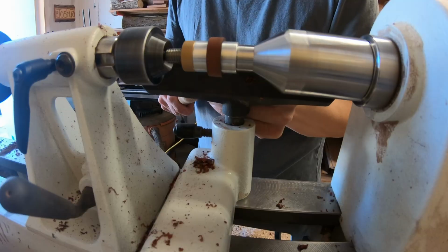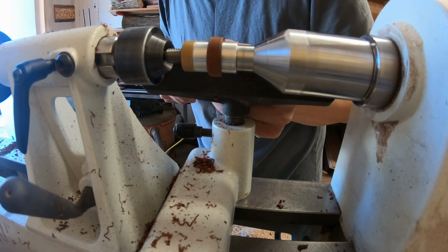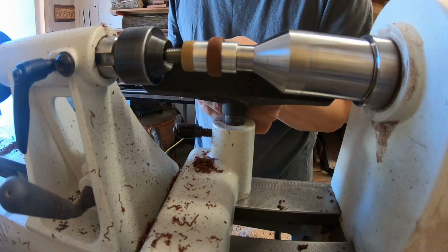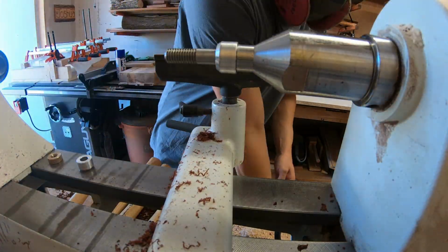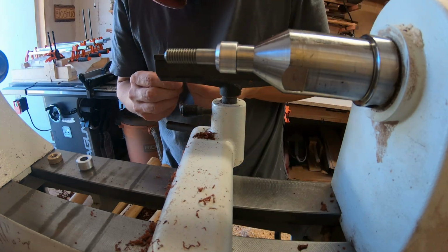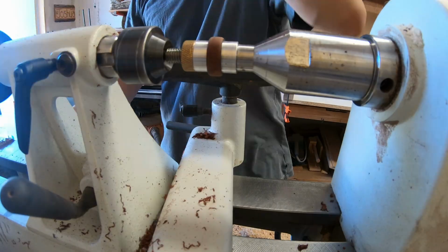With all the gunk cleaned off, I can throw the ring back on the lathe and get it down to its final shape. I'm no expert turner, so I don't have a ton of valuable input here other than to take it slow and check your measurements frequently. Fortunately, I've got enough experience now that I actually got down to the thickness I wanted fairly quickly without taking it too far. For the thickness of the ring, I found that about 2.5 millimeters is ideal after sanding.